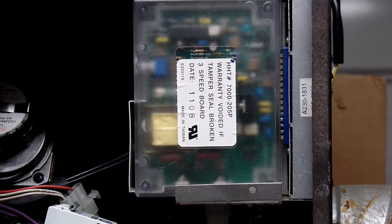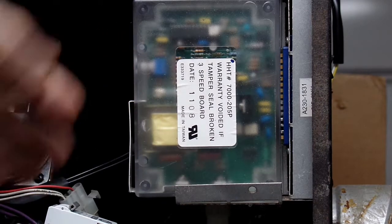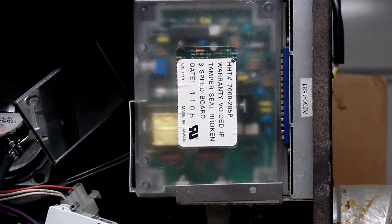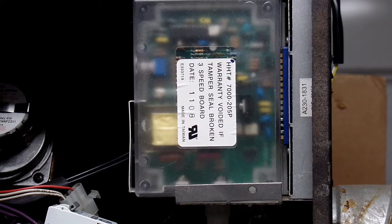I have it in my test stove, hooked up to a thermocouple simulator, and I have my meter which is reading the voltage to the element — so it's not actually going to turn on an element, it's just going to give me a voltage reading. On this Castile type stove, the call for heat light associated with the thermostat is hidden way behind the controller, so it's a bit hard to see. When I have it on, I'll carefully put my mirror back here and we'll see it on so we can be sure that it's working.